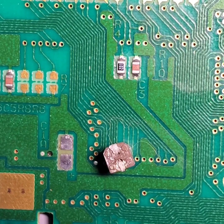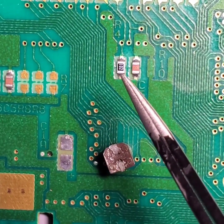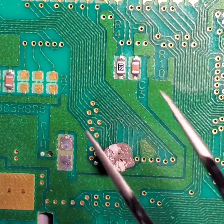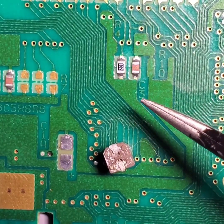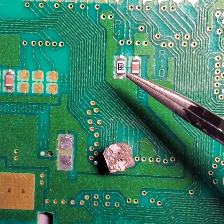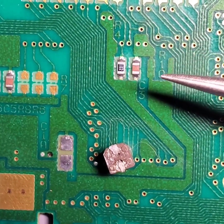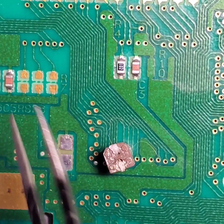Now, if you look at the surface mount components up on the top hand side of your screen, I believe one might be a resistor, the other one a diode, or vice versa. I'm not really sure. I'd have to double check those. But actually, no. That one says C3, so I believe that's going to be a ceramic capacitor. That one says R4, so that's going to be some sort of resistor. I'd have to look up the 102 stamping on it. And then it looks like it had a place for another resistor for different game boards. And then you also have some unpopulated areas over here.